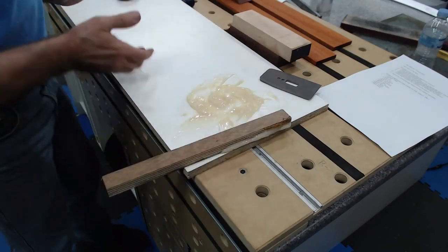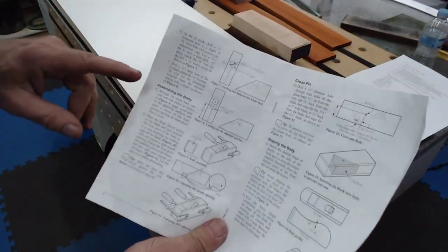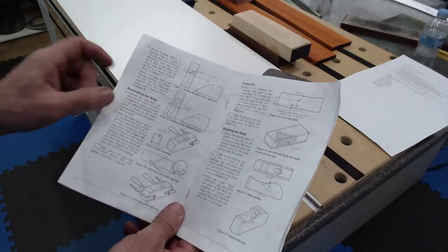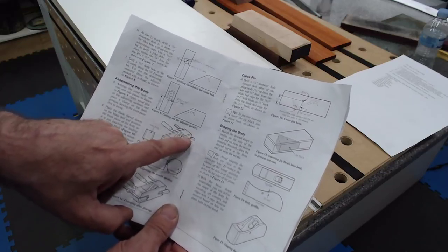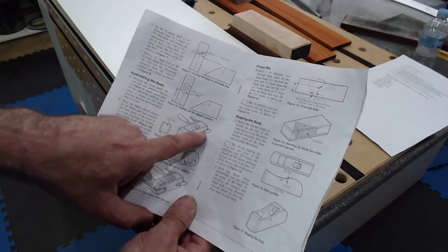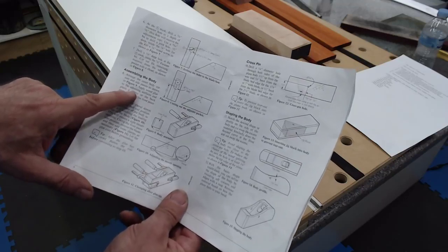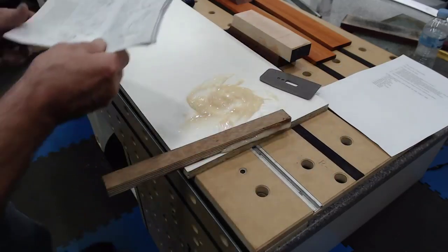There we go. All right, next. It says in my book here, we'll do some reading. Okay. Arrange the inner body cutouts and side pieces as shown in figure 9. There. See, they've only got the clamp on the heel of the base of the foot, of the sole, the rear end of the plane. The front, they haven't clamped yet. So apply wood glue to the adjoining surfaces and place a clamp on the back portion, leaving the front piece free to move. So we're going to do that now.